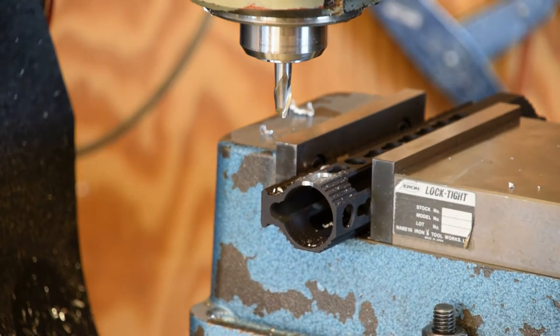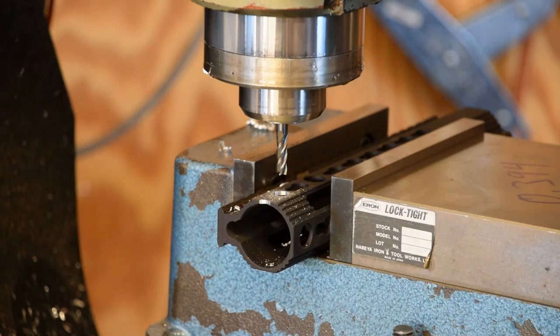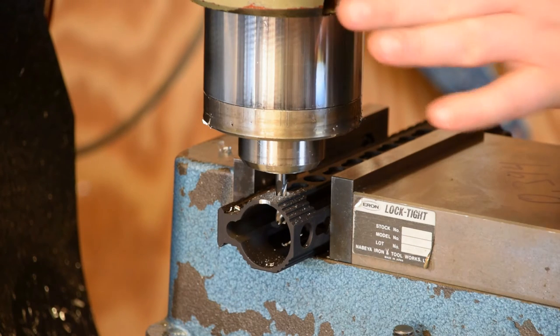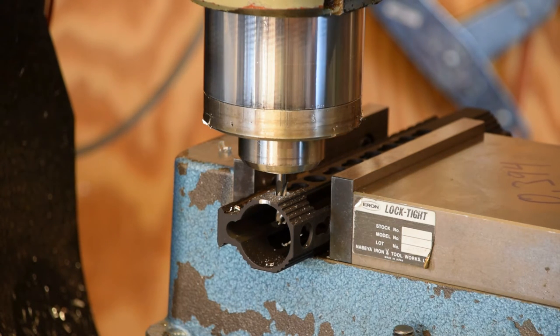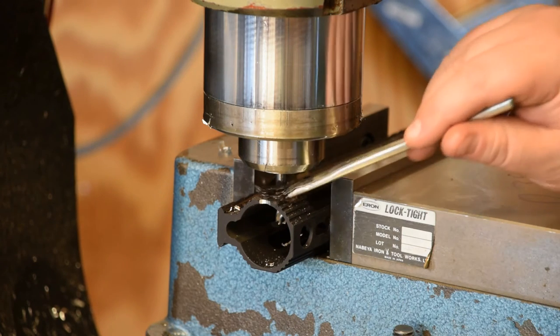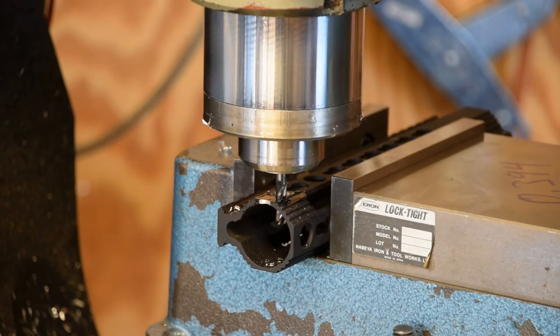And we'll make the key slot part of the slot. I've got my tool changed now. The slot width is .234, which is 15/64ths, and I happen to have a few end mills that size — they're re-grinds I bought, and that just happens to be what they finished at. I got lucky. I would rather have a two-flute for this since it's aluminum and we're slotting, but all I've got is a four-flute, so we're going to roll with it. We've got .394 inches to the end of the slot, so I'm going to spin it up, put a little cutting fluid on there, and go ahead and cut this slot.